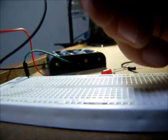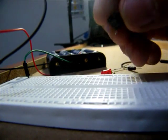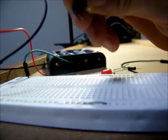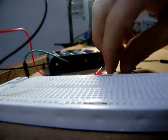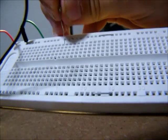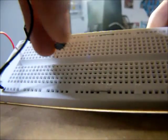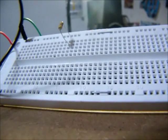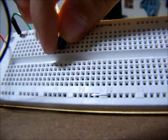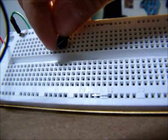This is a button, also commonly referred to as a switch. When it is pressed, it will flow electricity from one of the legs to the other leg, depending on how I hook it up. So, first, as always, I'll take a resistor so I won't fry out my LED. Stick it into that top hole into one of those columns. Then I'll take this button and put one of its legs into the same column as that resistor. The other leg will just end up being somewhere else, and it will still work — it will flow through that button when the button is pushed.